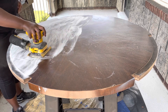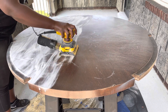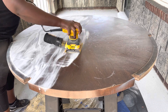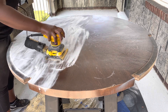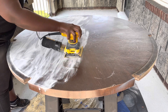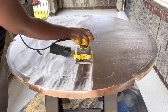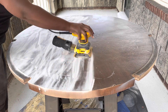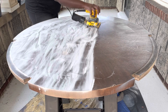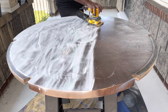I am using a 120 grit sandpaper. The pack from my local hardware store comes with an 80 grit, a 120 grit, and a 220 grit. The lower grits will really help remove any dirt and grime and also any top layers of stain or paint your piece may have. You always want to start with a low grit sandpaper and then work your way up to higher grits after you've painted or stained, so you smooth the surface more evenly for your top coat or seal coat.